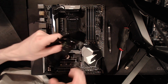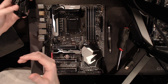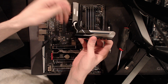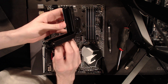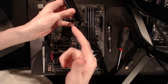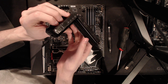But still, at least the board does have some airflow over the VRM. Though I'd prefer it if the VRM didn't actually need a fan to get its cooling. And that would probably have been possible if it wasn't for these lovely artistic bits of aluminum on top of the heatsinks, because if you look down the side, you can see there's actually surface area down there. Except there's no way there's going to be any airflow through that area, because there's a great big aluminum plate over it. Which is just like, yeah.